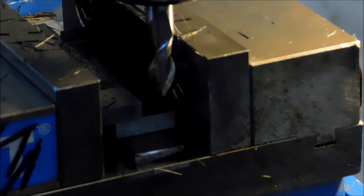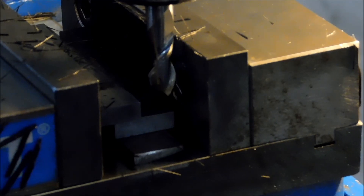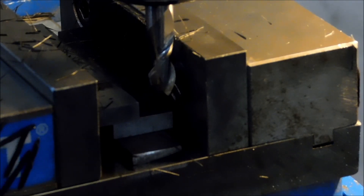My digital readout is set at zero for 0.120 thick, so I'm going to take it down to 0.100, which means this resultant shim should be 20 thousandths thick. Basically that's an impossible thing to mill any other way than what you're seeing right here.